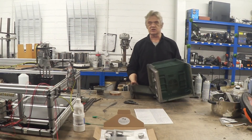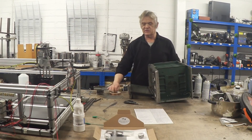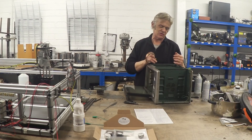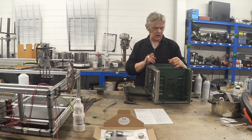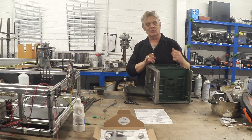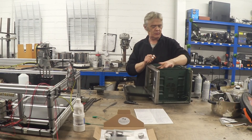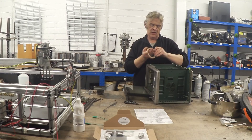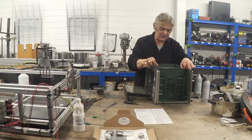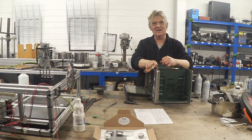I've painted the base metal with stove enamel — there it is. All I need to do now is put on the copper tape. I'm going to do a series of them — two on each side of the oven — and then connect those in parallel. That'll draw more amps and get a bit more heat. I'll put the strips of copper all around the painted area, and when I've done that I'll get back to you.